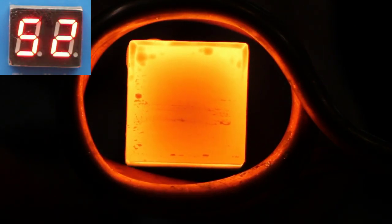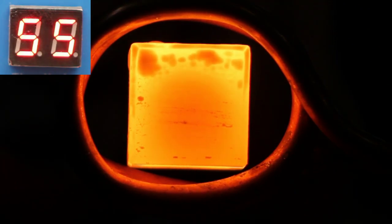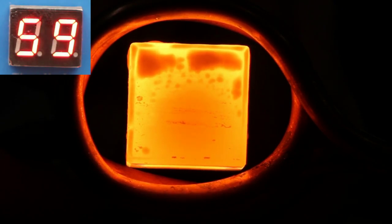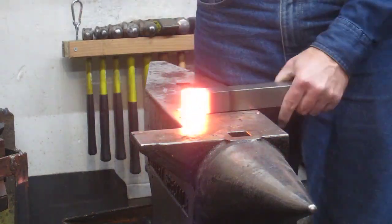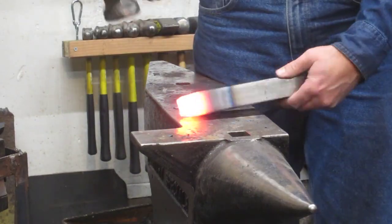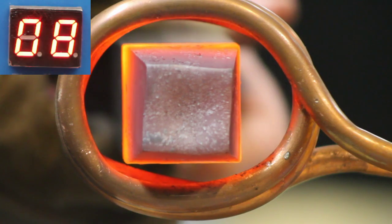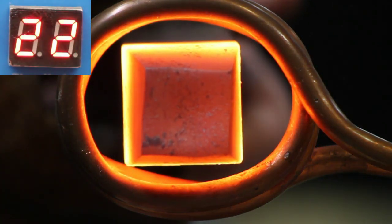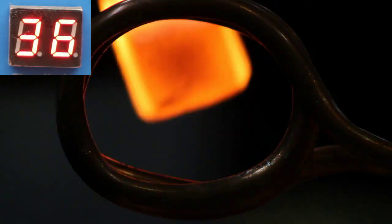The difficulty - and this occurs with the coal or propane forge too - is that from where I'm standing I'm not really getting enough heat to the center of this. So I'm going to get a little more fish-mouthing than I otherwise would, but it's going to be good enough to get started. Also note that the length of that heat physically is a bit short. Another example of why I should have propped. Notice that I'm a little bit twisted - I had the handle high as I was hammering. I'll correct that in the next heat.